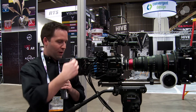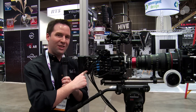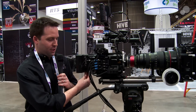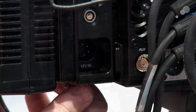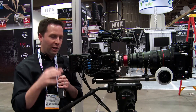If you're powering it off of a battery, this all works fine. If you're powering it off of a 12 volt XLR, you plug in right here. To prevent it from sticking out too far, they actually let you recess that connector right in. As you see here, I plug my connector in, push it back and lock it down — that enables me to get my XLR out of the way and power my camera really cleanly.